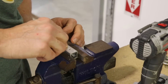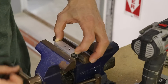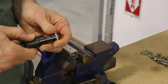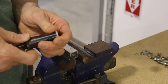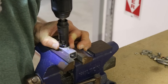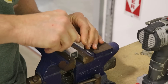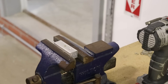Let me try this one again. The rivet still sticks out just a hair. Let's adjust this — I need to go deeper, so I need to screw this in. Let's try that. Actually, it looks pretty good. Put a rivet in — and that's perfect. There we go. Now it's adjusted, I can go drill the panel.